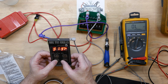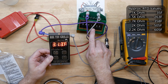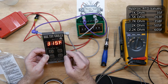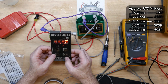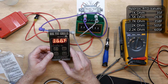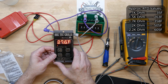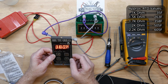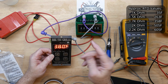The temp display toggle is working well. Let's go up to 1.7k — that should be about 358 degrees. So it should settle in somewhere there. Let's go to 1.8k. It does take a little while to settle in — it's a software filter so it's averaging, and every so often it updates. We can see how it takes a little while to settle in, but it's working well.